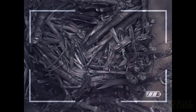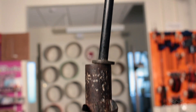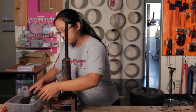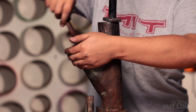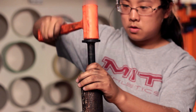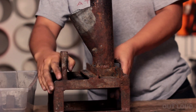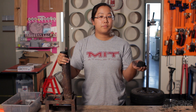We also need some kind of tool to mold the charcoal material from the kiln into briquettes. This is one of D-Lab's earlier designs for the hand press. We pour a mixture of charcoal and binder into the spout here, hammer down the piston, slide open the panel at the bottom, and the briquette pops right out. This design costs about $20 to manufacture, but the engineers at D-Lab wanted to do better.